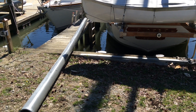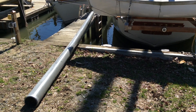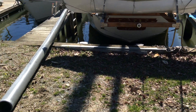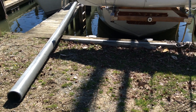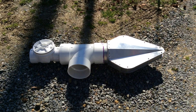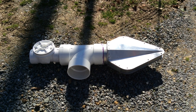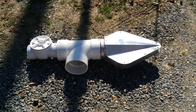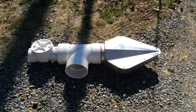We're here along the Chesapeake Bay in Maryland, going to install a dry hydrant at a marina. One of the issues is making sure you can back flush these things, so we wanted to use a low-level teardrop style strainer because of the tides in this area. The strainer works really well in our streams.